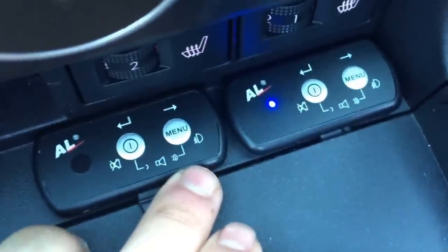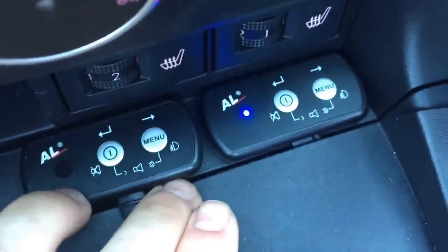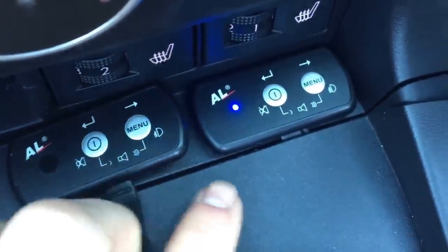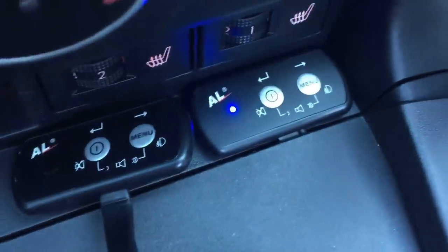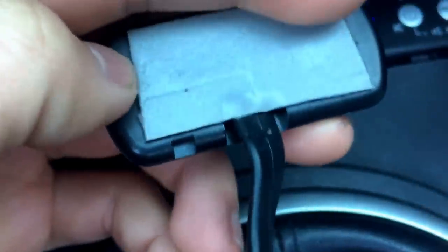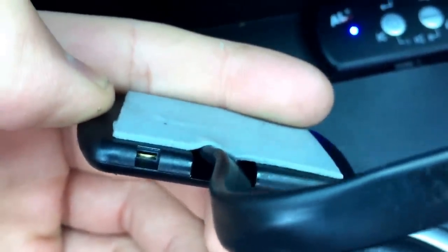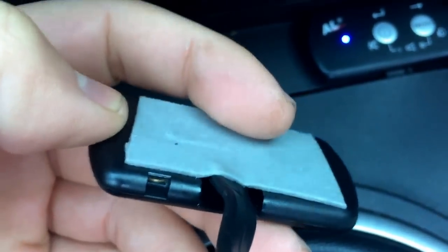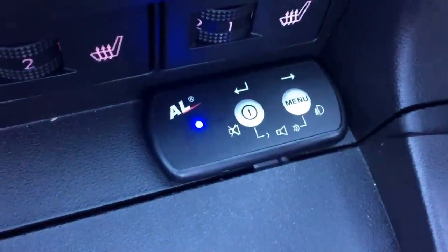There is a recent firmware release that actually allows you to now dim that light in software rather than having to put a little darkened sticker there, which is really nice. So on the new module I no longer have to do that. On the old one, if you take a look at the back, you'll still see the sticky tape I was using. On the back right at the bottom, on the left there's a cutout — that's the slot for the speaker. It used to be just beeps coming out of the control module itself, but now because there is an external speaker, that's no longer necessary.